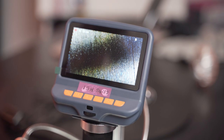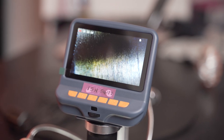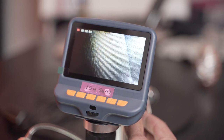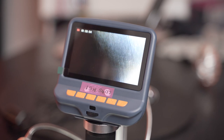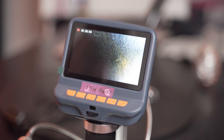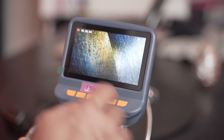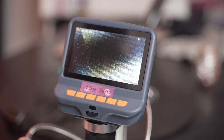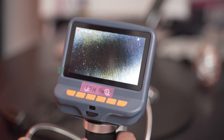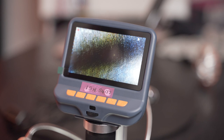Okay guys, so this is the machined upgraded compressor housing and let's just have a look at those striations. They seem to be a little bit finer than what Garrett's were. That's the radius profile. We're coming up to the rest of the radius over there. Let's just get this into focus. So I mean, those are the striations there. That little transition over there goes to where the flat surface is. And I'd say that that's actually finer than what the original machining from Garrett is.